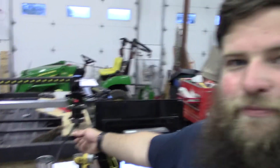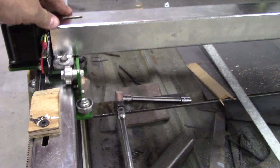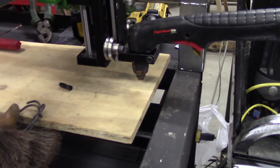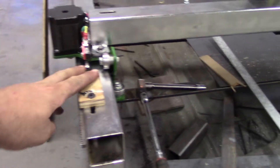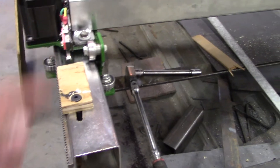Got the torch in there. Pretty much what it's going to look like, minus my temporary little wooden ramps here — these are for the home switches, so as it rolls up to it, it just clicks it. That'll make it so the torch is about an inch inside the frame when it activates. I'll have something similar on the other end for the limits. I wanted to make these out of wood just to see if it works first, because otherwise I'll need to figure out another way to mount the switches. That's going to wrap it up for this video — thanks for watching.